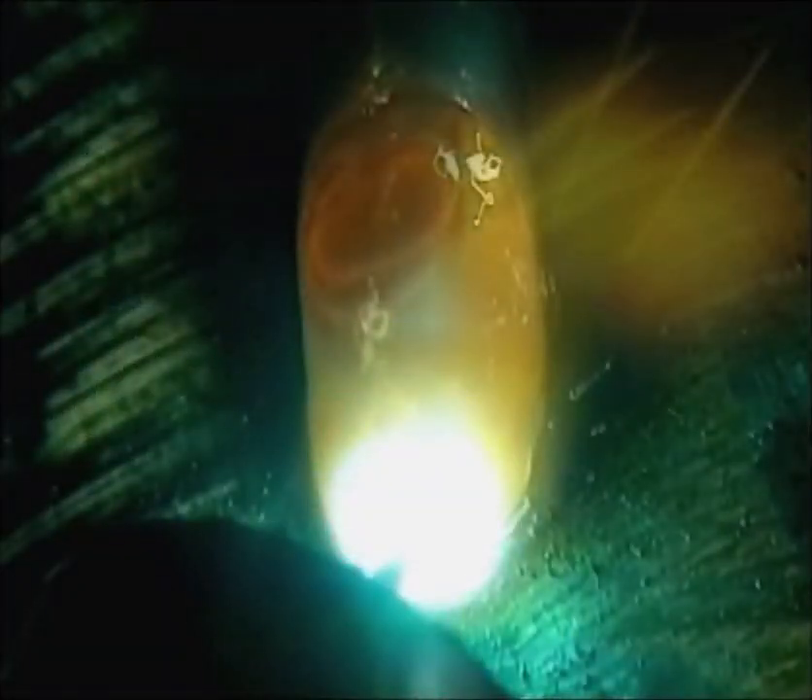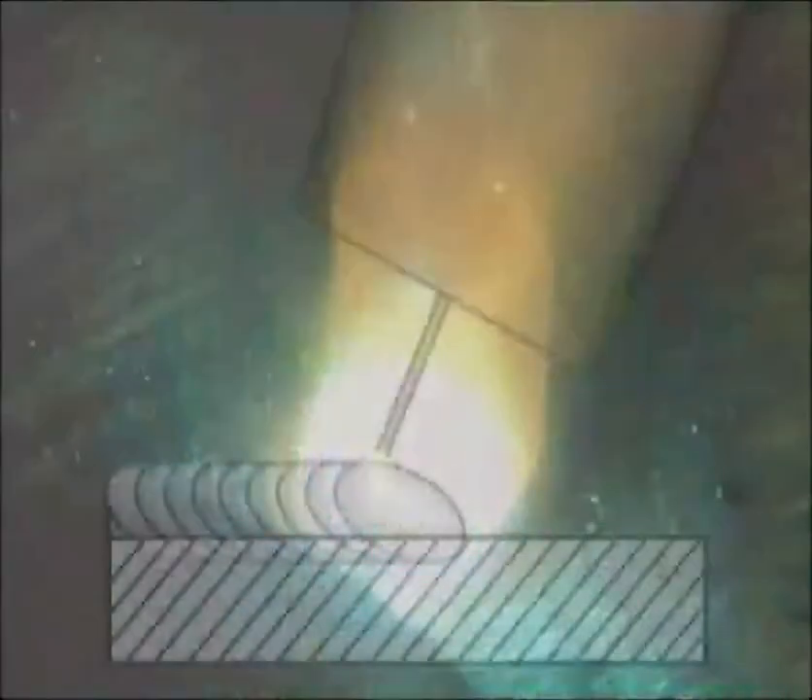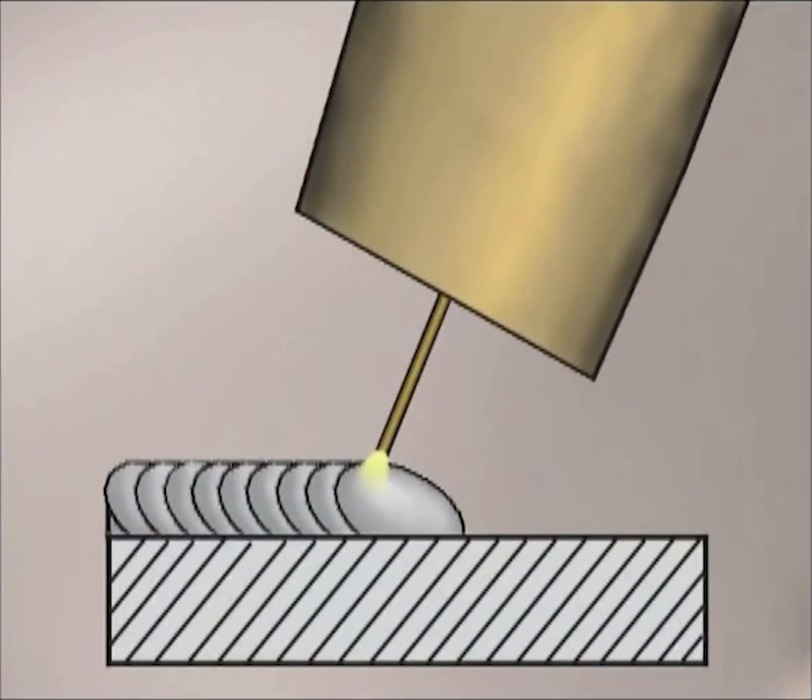With the arc on/arc off characteristics of short circuit transfer, there is not a lot of arc force to help drive the filler metal into the weld. For penetration and weld fusion, you want to keep the wire and arc directed at the leading edge of the molten puddle. Where the wire hits the weld puddle makes a huge difference. If the wire is directed at the back of the puddle, with molten metal floating in front of the arc, the weld buildup keeps taking the heat, not allowing the base metal to get hot enough to melt. The weld can actually float right on top without penetrating or fusing to the base metal. For good weld fusion, maintain the short wire stick out and stay ahead of the weld, keeping the wire on the leading edge of the puddle.